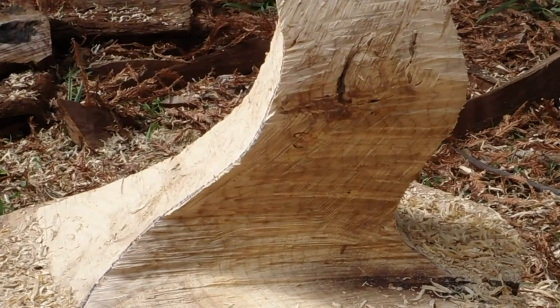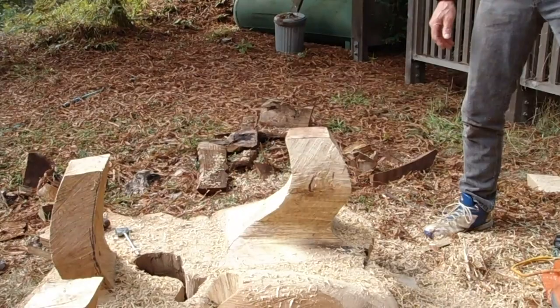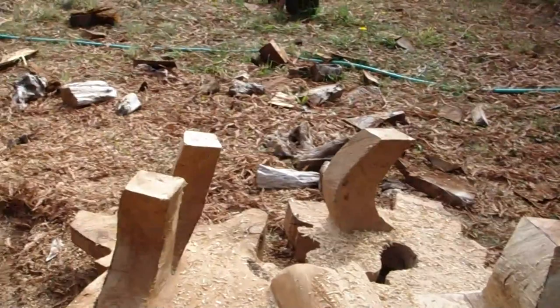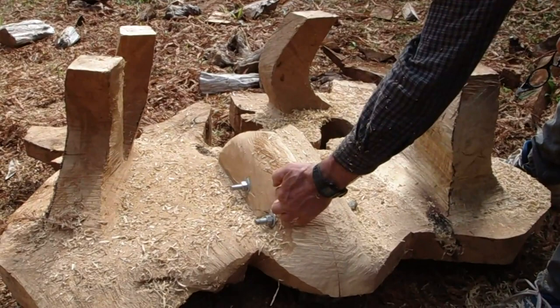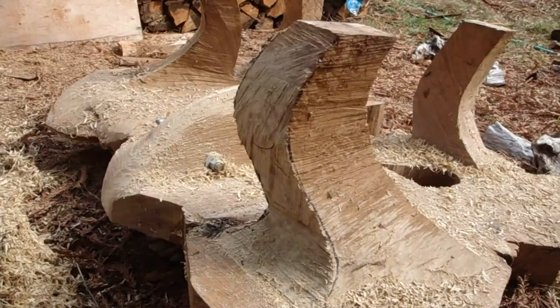That's all I'll do now. I like to work it down to about three or four inches — it's about three inches thick this way — so that's good for drying. After it's dry I'll finish shaping everything and get it to the dimension I want. On the back of the table where the bolts are, it's amazingly strong. Eventually I'll inset the bolts and plug them, so you won't see them. From being stocky it now has a lovely shape. The next step is the kiln — it'll stay in the kiln about six weeks.